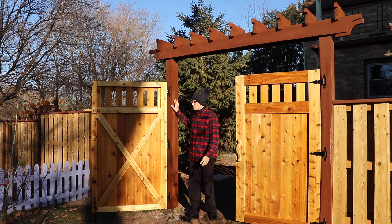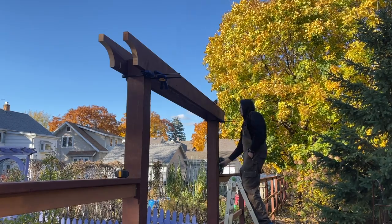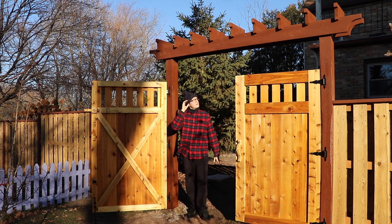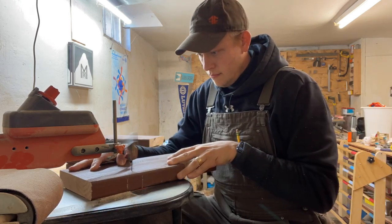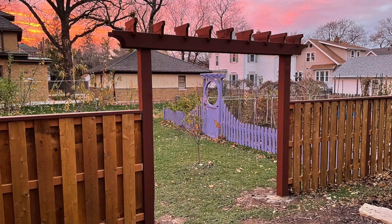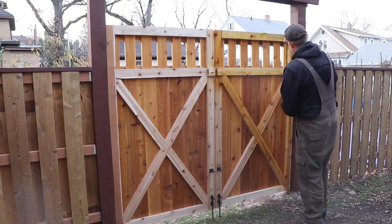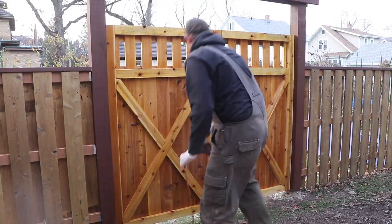For the arbor, I wanted the posts to be super rock solid. The rest of the fence has four-by-four posts, but these are six-by-six and about three feet into the ground — very deep, since they go more than eight feet tall from the surface. I wanted something simple but a little showy. It's a two-by-eight twelve-footer going across, with perpendicular pieces up top as well — both aesthetic and functional, providing rigidity. Maybe a flowering plant will grow up there in the future. This entire project was sealed with an exterior-grade sealant rated for my area — if you're putting money into cedar, seal it to extend its life.